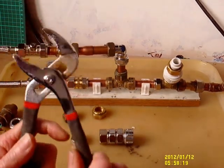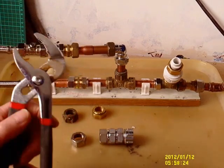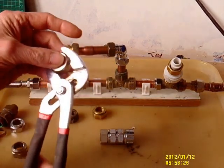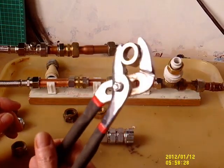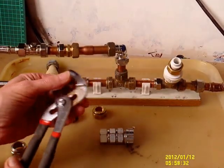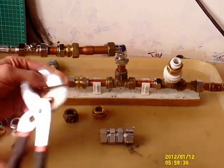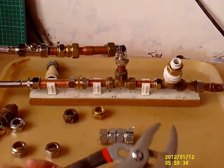So next, some people use these — the water pump pliers. It has its uses. Obviously it's adjustable, but it does rely on having room to swing it and a good grip. Otherwise it will just turn. Sometimes you just haven't got the room. It's also rather long.